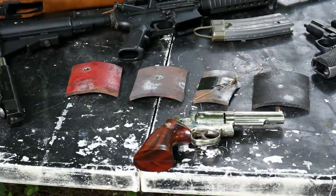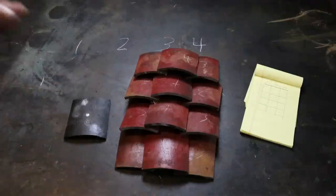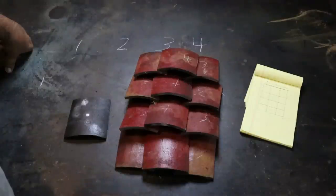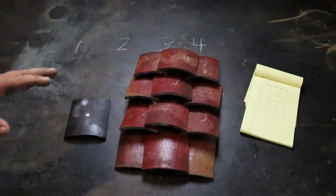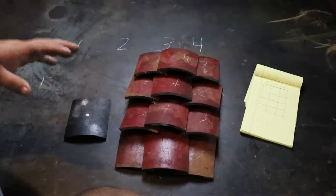The oil-quenched plate took a .223 hit and I'm going to lay these out so it's going to be more of an eastern-influenced type of armor — kind of a samurai-looking thing. But before we harden these plates, I'm going to throw them in the forge, get them hot, forge them flat, and anneal everything. I will then grind these into the size they need to be and start getting them in shape to lay flat.